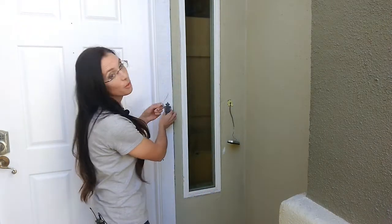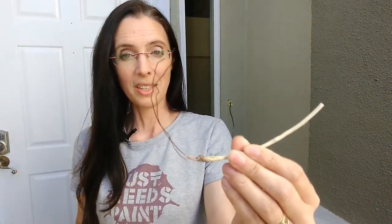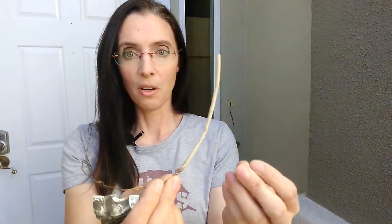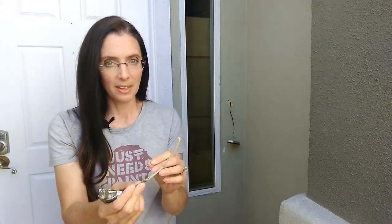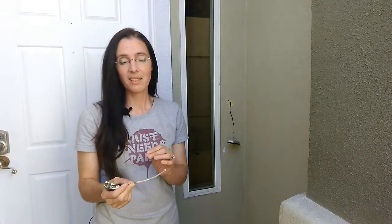This project didn't go the direction I thought it was headed, but a flexible drill bit is perfect if you need it in this situation and use it right the first time. I started by removing the old doorbell, and when I did, I discovered the state of the cable. If you even looked at it wrong, the sheathing fell off. Rather than creating a fire hazard with arcing between the lines, I knew I had to replace it. We're replacing it with 18-2 — thermostat wire — a heavier gauge that can handle the demands of a video doorbell.